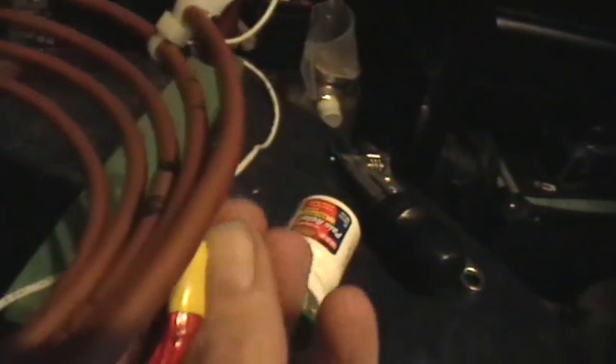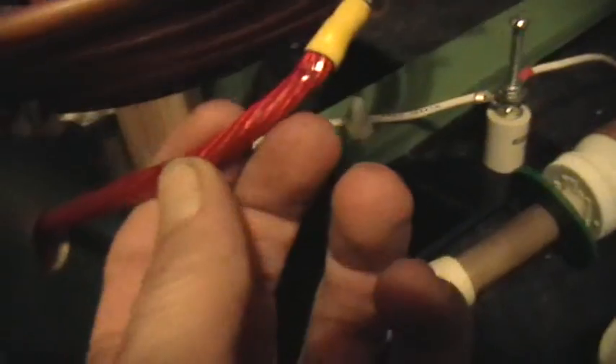I have it tapped at about two and a third turns, which is where I determined from both calculation and experiment the tap should be. So I made a little clamp out of some copper sheet to make good contact there, and then used some really heavy wire to come over to the other end of the coil, which is trapped in the pillow block there.